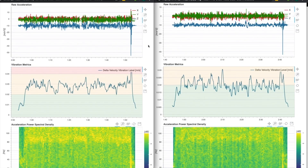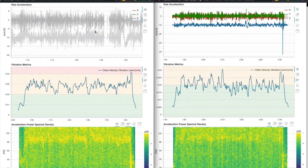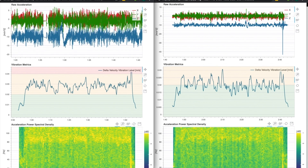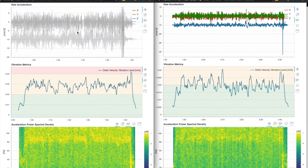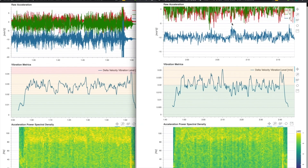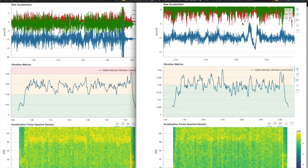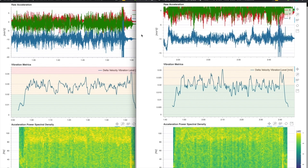Taking a quick look at raw acceleration: the documentation tells us we want the Z-axis to be fairly isolated from the X and Y, with not a whole lot of overlap, and that's specified in a hover scenario. Obviously in acro or aggressive mode there's going to be overlap, but there's a lot of overlap here just in a hover scenario. In the scenario on the right where we've put the good foam in place, there's not much overlap — so that once again tells us we have issues with vibration.